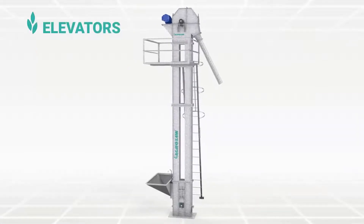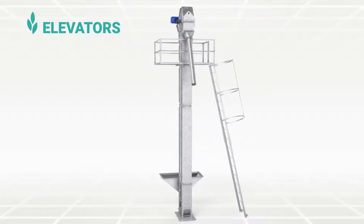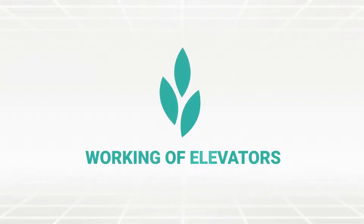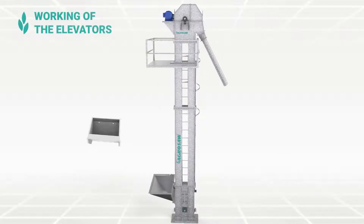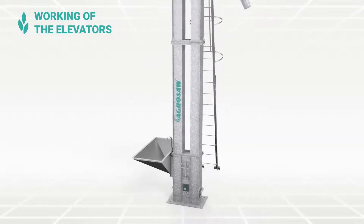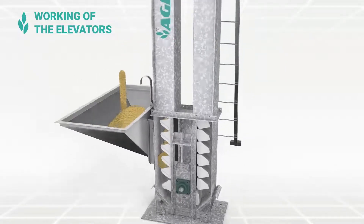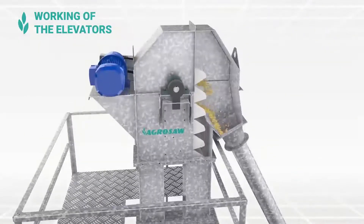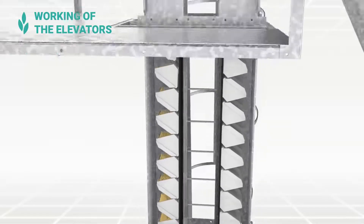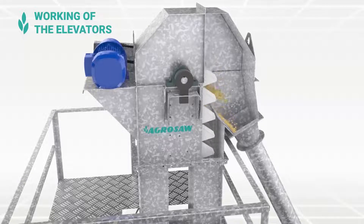Agrosoft elevators are ready-to-use type. These elevators are designed for the gentle handling of the material and have a long, rugged service life. The buckets are strongly bolted to the belt. These buckets lift the flowing materials evenly from the hopper and elevate them to the head of the elevator smoothly. In the head, the material is discharged for further processing. These bucket elevators are generally equipped with casing to prevent the discharge of dust into the surrounding environment.